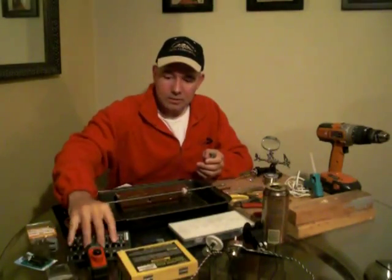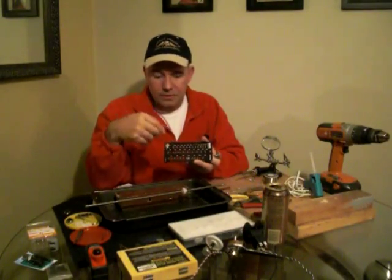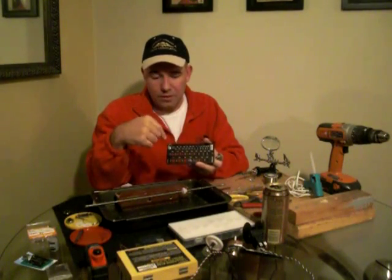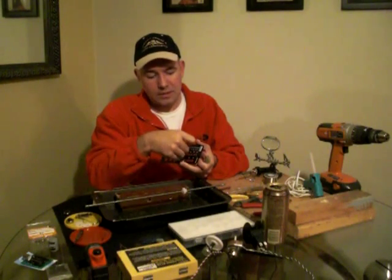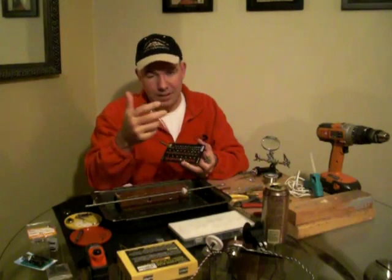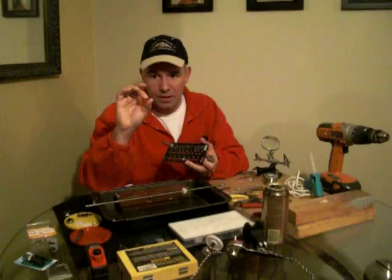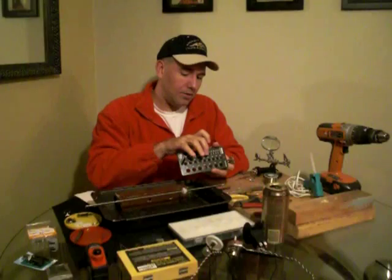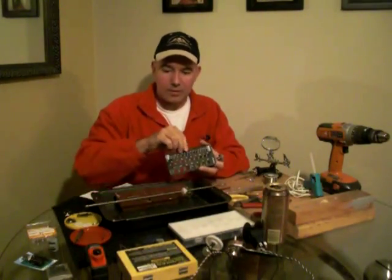You also want to get some drill bits. I like to use a drill guide so you get precise measurements. We've got a quarter inch drill bit, a 9/64th, a 1/8th, a 7/64th, and a 3/32nd. The 3/32nd and 7/64ths are great for pre-drilling holes for inch-and-a-quarter drywall screws, and 1/8th inch is good for pre-drilling holes in the metal for those drywall screws to go in later.